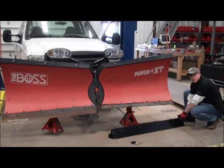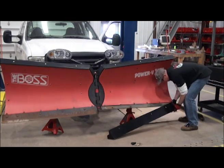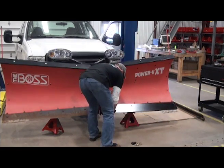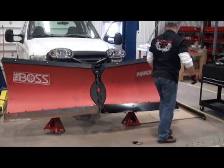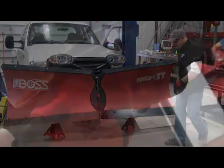All right, what I like to do is line up the outside edge and put a bolt in the outside one first. Then I go to the center, lift it up using my legs to lift, and place a bolt there. Now I'm going to start one of the washers and nuts on the back side so that the blade isn't popping off as I install my other bolts.